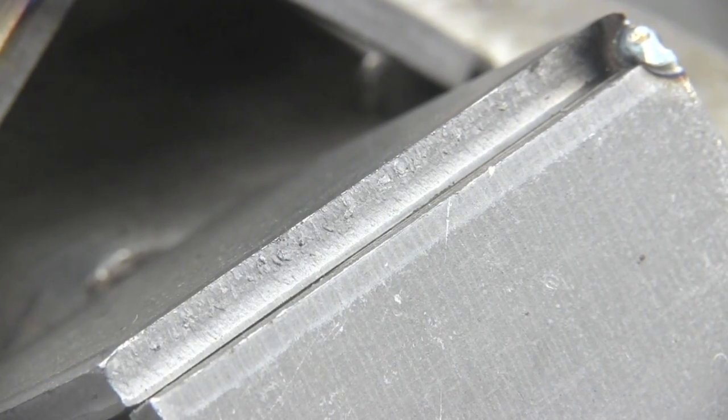Now we're going to weld the quarter inch at that setting — max voltage, but somewhere around eight on the wire feed speed. To start with I'm pulling this, and you can see it is not getting down to the very bottom of that root like you would want. It's maybe 80%. So if I used a different technique or propped this thing uphill, I could get it done — definitely could get it done uphill. Or I could get it done if I used CO2 gas instead of 75/25, but keeping everything the same today. Now we're going to be pushing a little bit, and you can see it's flowing down in there maybe 80 to 90%, but not really melting down into the root. So you want a little bit more power for quarter-inch thick here.